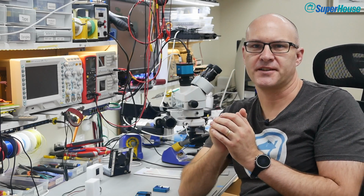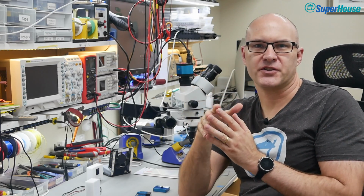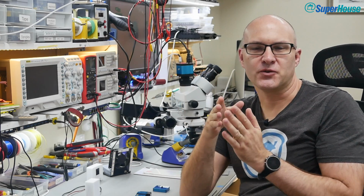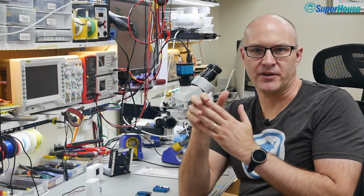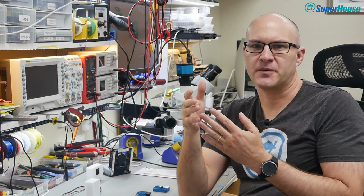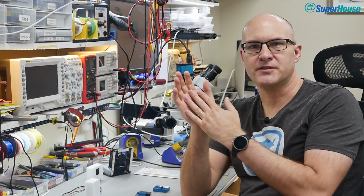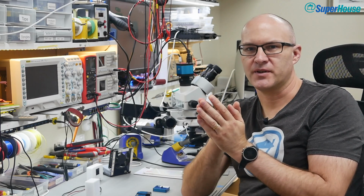But it gets even weirder than that, because the wavelength of light is somewhere around the 0.5 micron range. So what we're talking about is detecting objects that are so small that they are in the region of the wavelength of light itself. And when you have light interacting with an object which is as small as its own wavelength, it doesn't really behave like a particle anymore. It starts to behave like a wave. And so its characteristics become quite different. You find that the light itself can bend around the back of an object and it interacts with the surface of it in interesting ways.